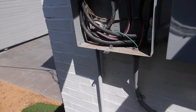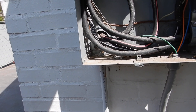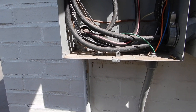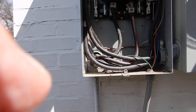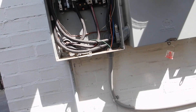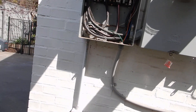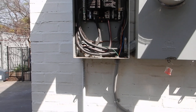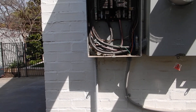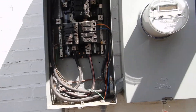The bonding location is inside the garage, southeast corner closet, on the main water supply where the main water shutoff valve is. That should be labeled in here. Otherwise the electrician would have to go on a treasure hunt to find where the bonding was, and a plumber would have to go on a treasure hunt to find the main water shutoff valve — probably have to do it at the meter.